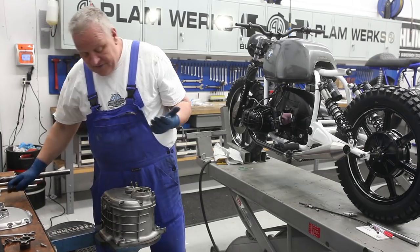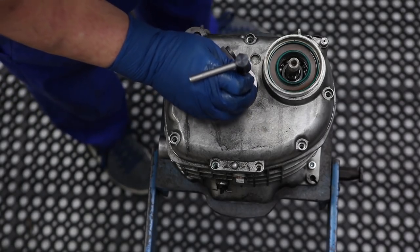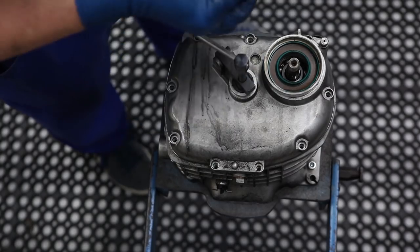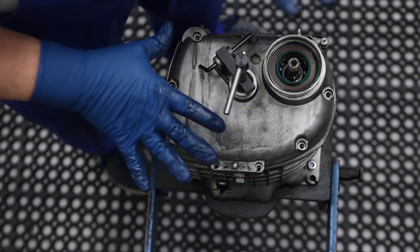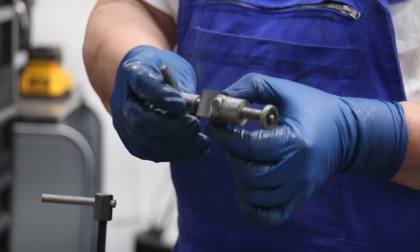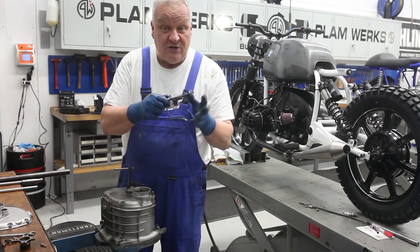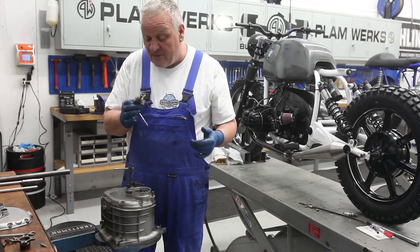This is how the tool looks — it fits right in with a little foot that goes on to the bearing surface. A shaft or bolt goes through, you tighten it, and it lifts the cover right off. You can make something like this yourself — here's a crude one I made on the lathe some years ago with pretty sloppy welds, but it totally works. You can size it up and make something similar, or have somebody make it for you.